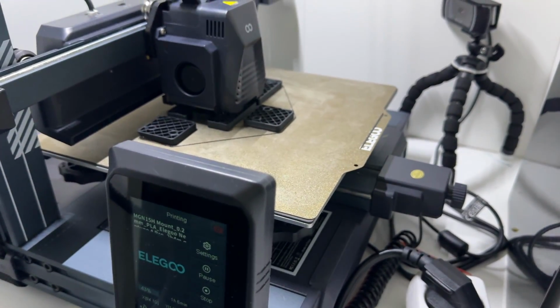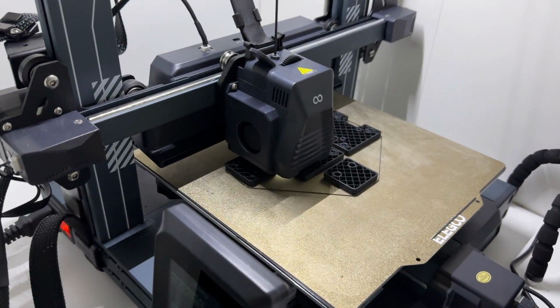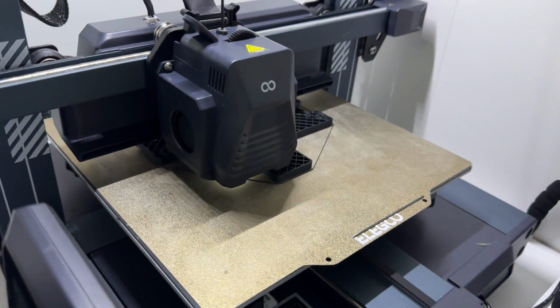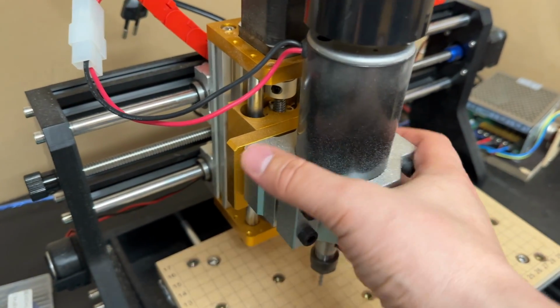In my case, I was able to use models I found on Printables, and I'll link them in the description. I printed the parts on my Elegoo Neptune 4 Pro 3D printer using 30% infill for added strength, and I used just regular PLA filament.